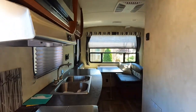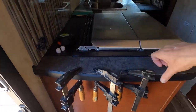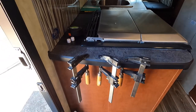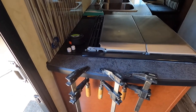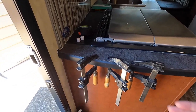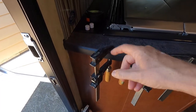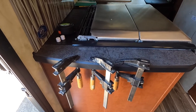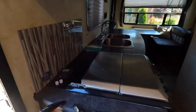I've had this trailer for about 20 months and there's some wear and tear. This side covering for the countertop was starting to come apart. Paul knew that this side piece has a tongue with spikes in it so that it adheres to a groove inside the particle board of the countertop. He took it off, cleaned it out, used wood glue, and is now clamping it so those spikes will adhere to the particle board again. We'll give it time to cure and it should be just like new.